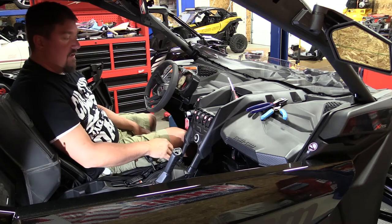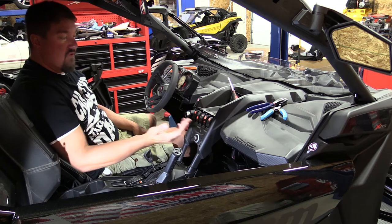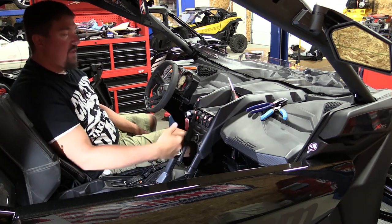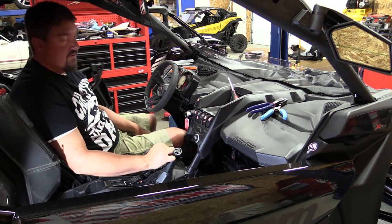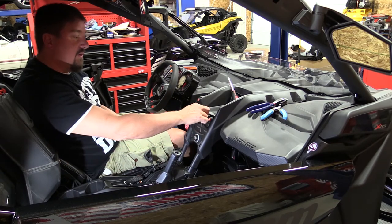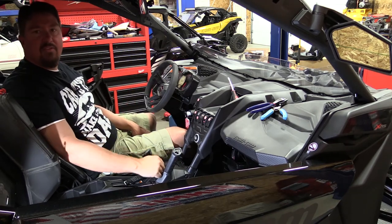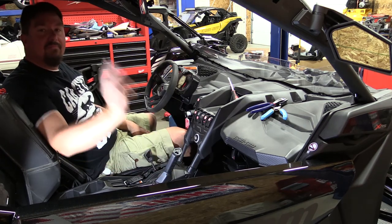That's going to be our setup. Now here we simply have power anytime it's on — we can hit that, no issue. I like that setup because there's a little bit of safety in that this switch is not powered and nothing is able to happen unless we have our remote hooked up in the dash or we have our auxiliary power on. We also have the benefit of some USBs sitting here. Pretty cool system. Hope this helps you out if you're wiring up your winch and didn't like that it was hot all the time. Thanks for watching — make sure you subscribe to this channel, we appreciate it. We also have a channel at workshopaddict.com where we go over tools. Thanks for your time guys, have a great day.